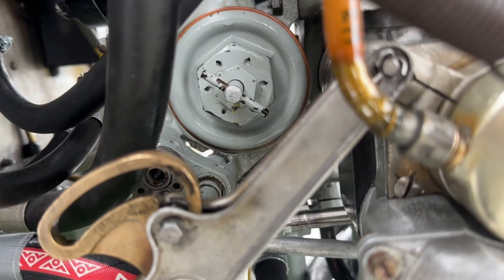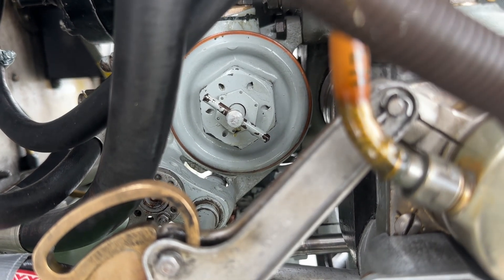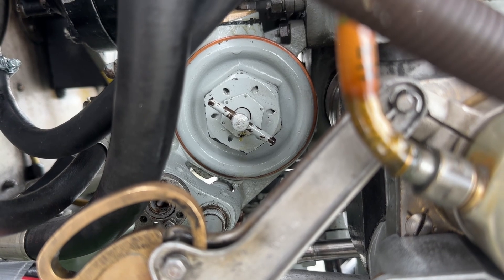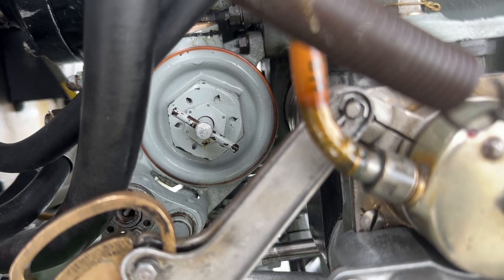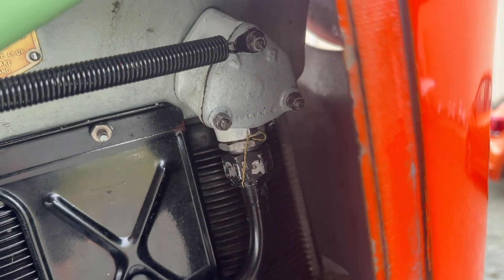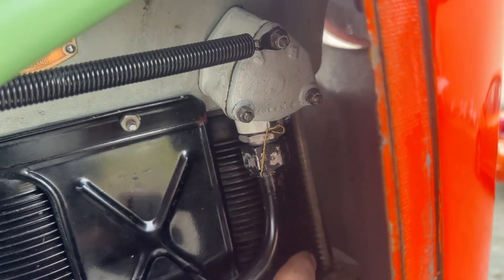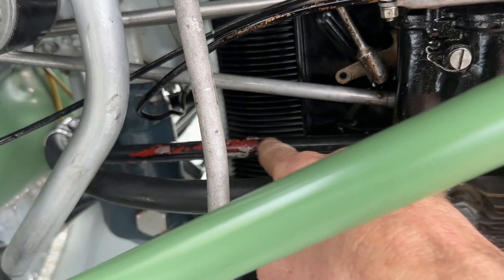Further down, we've got one of the oil filters — that's the high pressure oil filter. And on the other side is the suction filter, which we didn't really have a good look at. Scattered around the engine are other coarse screen filters; there's one at the front here on the scavenge pump. If you were to take this cover off, you'd find a little mesh filter designed to stop any metal particles making their way back through this oil return line back into the engine.